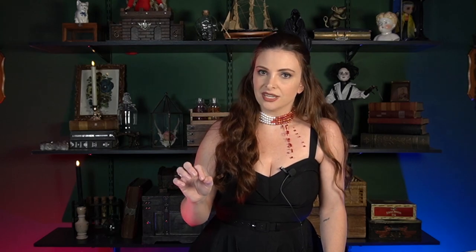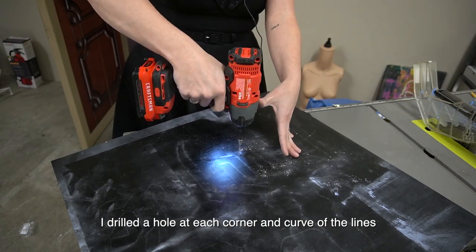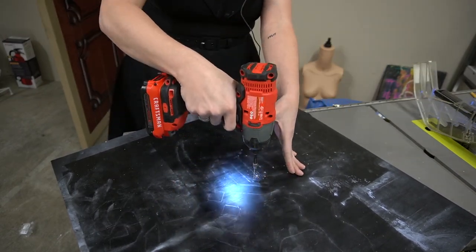At that point I'm going to drill a bunch of tiny holes and screw in these little eyelet screws. They're normally used for jewelry making but I've found that feeding EL wire through them works really well to make shapes that you can't really make if you're trying to glue it down or feed it through thicker tubing. The reason I don't want to glue it down is because I want to be able to replace the EL wire if I need to in the future. Then once I have all the holes drilled I can use a jigsaw to cut out the final shape.